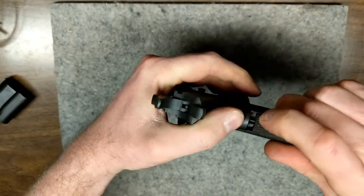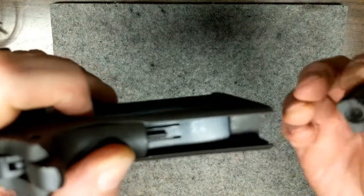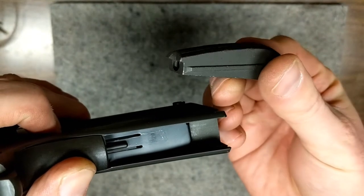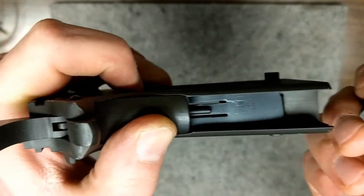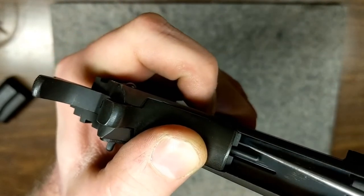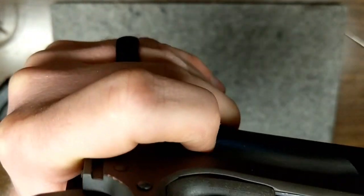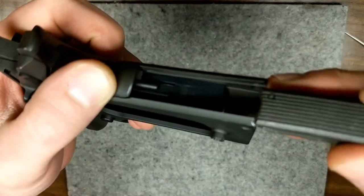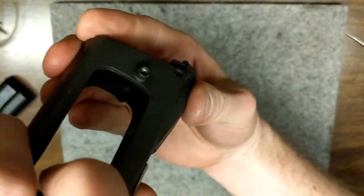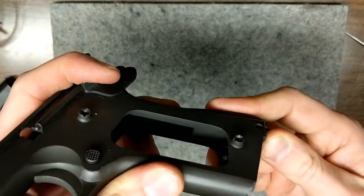Next step we're gonna have to do is get that pin to go into the plunger hole. So remember, on the spring assembly, you got the plunger. Well, now you gotta get this pin into that divot right there. And then you also have to keep these two from ending up on the outside there. And this spring wants to jump out of here. So let's slide this in before it disappears. All right, so we got that all captured in there. So what I'll do is I'll rotate it on its back here, and hopefully the pin will end up in the right place.